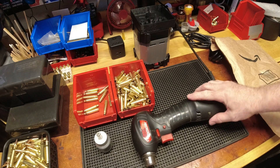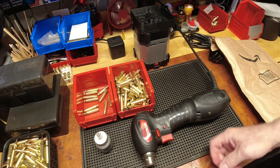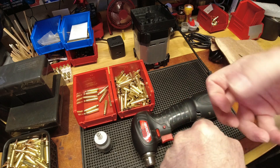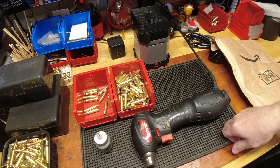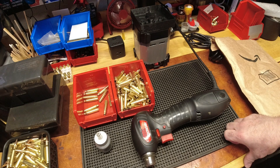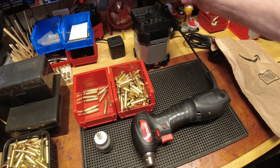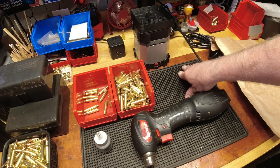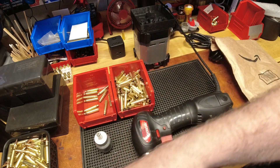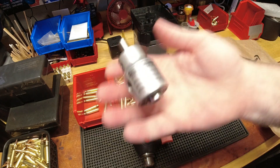I have a number of ways to trim — from the most basic Lee manual holding it in the stud and doing the wooden ball cutter, to their quick trim, to a Lyman trim-a-hand trimmer, the pencil sharpener trimmer, and the Lyman Brass Smith. A whole bunch of ways to trim. I like the Brass Smith because it allows flexibility across different calibers, but there's the adjustment pain in the process.